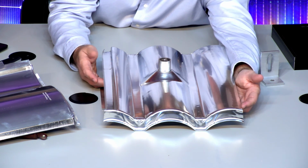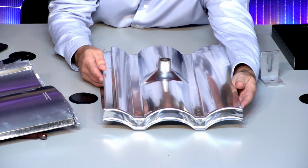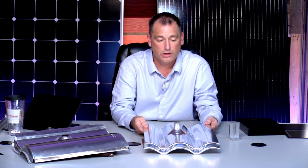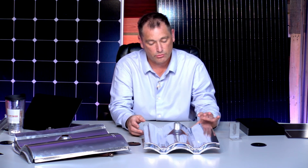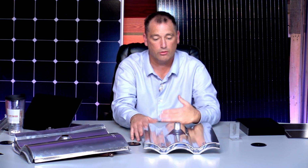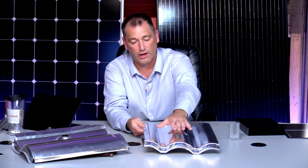We went there, we couldn't simulate it, but what we did is we put a lot of sealant up underneath of that, like a rubber sealant, and after that, if it moves around, it sounds like this. There's no sound to it. So we're waiting for a 40 or 50 mile an hour wind in our neighborhood again to see if we solve the problem. I've had some people tell us that's exactly why they don't use these, because of the noise issue, because they don't sit down really tight. They sit with the tiles on top of them. This will sit underneath another tile, so it's weighted down. And then on top of that, you have the L foot. This is not going to go anywhere. It cannot go above this. It's not going to leave.